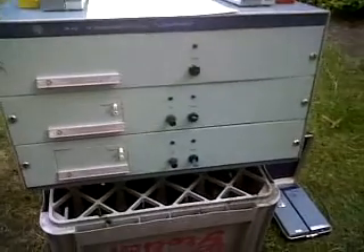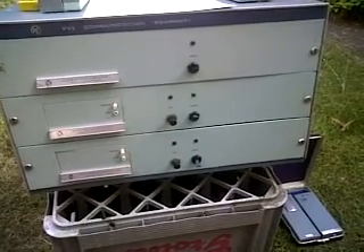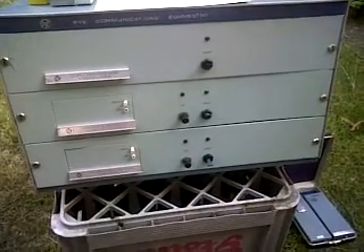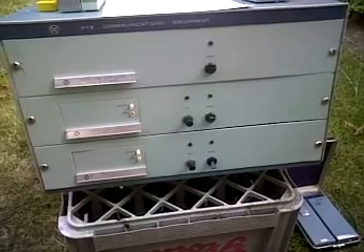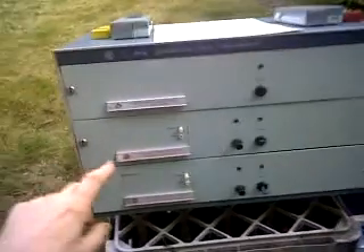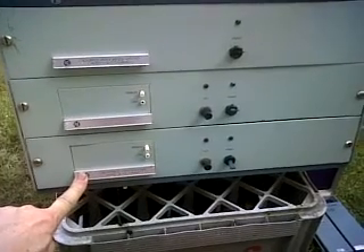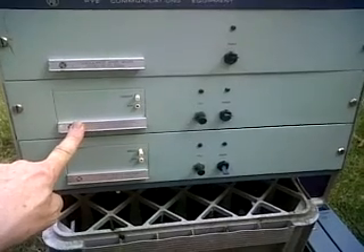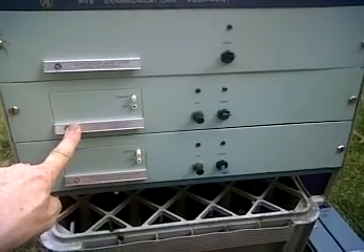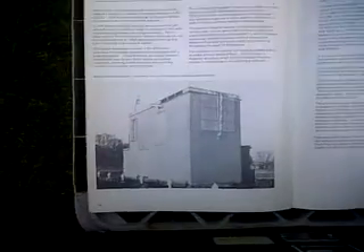It's a Pi on-frequency repeater. What does that do? It's quite a difficult machine to explain its operation, but basically, as it says, if you go in on 433.075, you come out on 433.075. And so there is a go path and a return path — the return path being half a watt out on frequency, and the go path being up to 5 watts output on frequency.